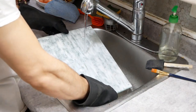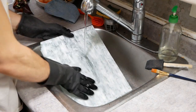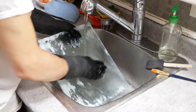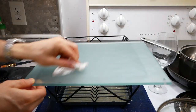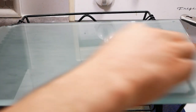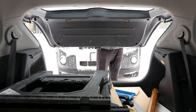Did I mention that this stuff is super toxic? I'm pretty sure the sulfur smell is sulfuric acid literally burning the glass, so you definitely want to wear gloves, a mask, and safety glasses while you're using this stuff. I would not recommend glass etching cream to frost a big piece of glass like this one. The second coat definitely improved things, but it was still blotchy and streaky. If I were to do this project again, I think I would just use glass frosting spray paint and save this stuff for the custom wine glasses.